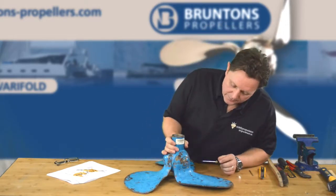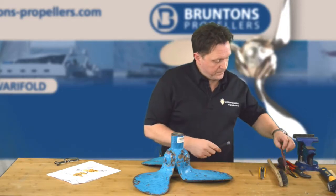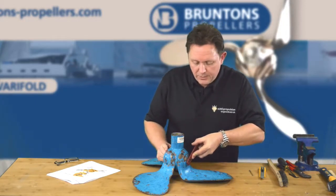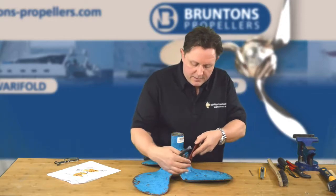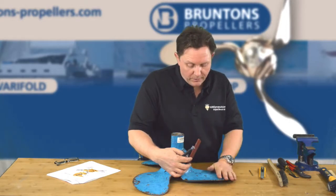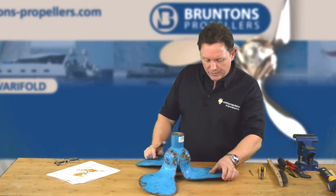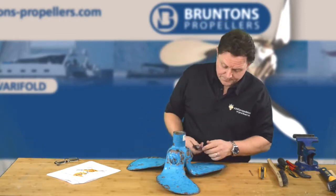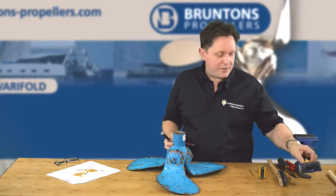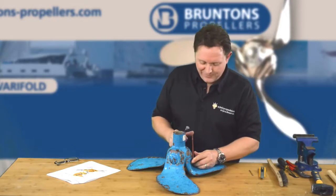The other thing is all the paint has got into these four little holes. This takes a little peg spanner that goes in here, and we need a good fit for these because we have to break these. Now this one here obviously has a lot of force. So once we have to break it, we either hold the blade down. In the factory these are held in a vise this way around — it depends how you do it. I think for this one we'll just probably hold the blades down, and it should just be a straightforward tap. It's just having the right tool and the right application of strength.